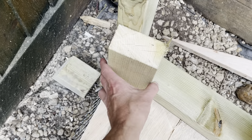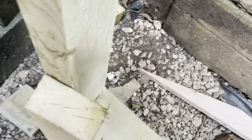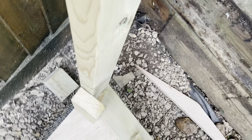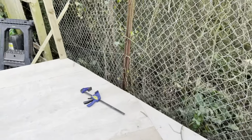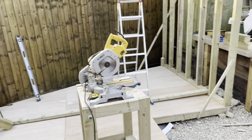You can see here with a piece of timber - it sits in there nicely, bringing the frame this way. You get a nice tight butt joint, it'll screw in and be rock solid. That gives us the angle. I'm going to do that type of joint on every angle - it kicks there, then you do the same. All the way around. It's quite a bit of work but you just take your time, it's not difficult, you just follow the same formula.